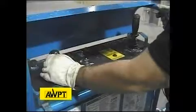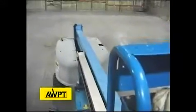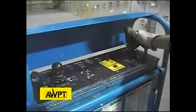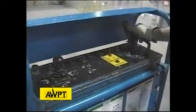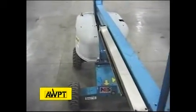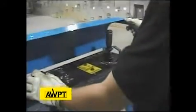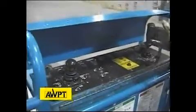We have not achieved it yet, so we're going to boom up slightly higher. Now we have elevated drive cutback speed, which is limited to 1 foot per second of travel speed. We have it in forward and reverse. Now we're going to lower the machine to make sure we regain our high-speed travel. It means we have one more limit switch to check. We have high speed back.